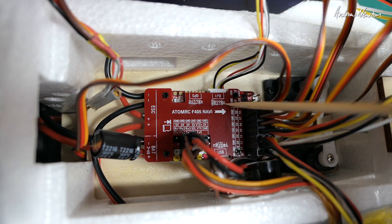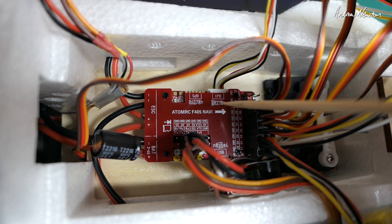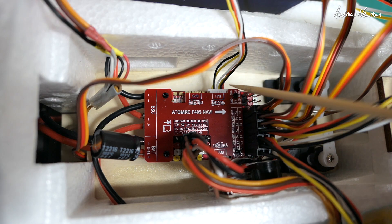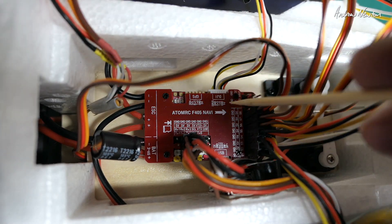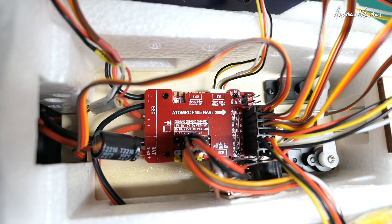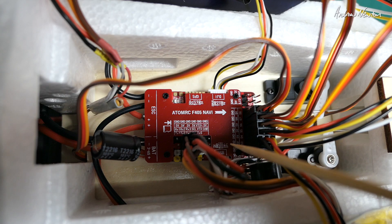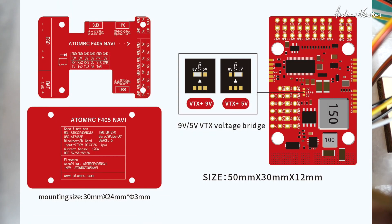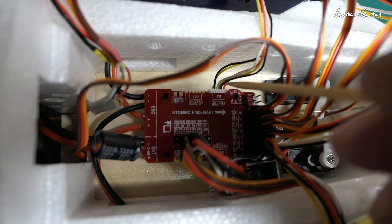The last thing is the DJI camera. They supply a little socket to plug the DJI into, which is very nice — that is on UART5. I'm not using the DJI controller so I don't need the SBUS on the ground, but we've got RX, TX, ground, and 9 volts. That's important to know — this is at 9 volts, which is what you need for the DJI. If you're not using DJI and you plug into the video transmitter, the VTX voltage is either 9 volts or 5 volts, but it's not active until you bridge the little solder gap. You have to decide whether you want 9 volts or 5 volts to get that pin active. Whereas the DJI connection is already at 9 volts.